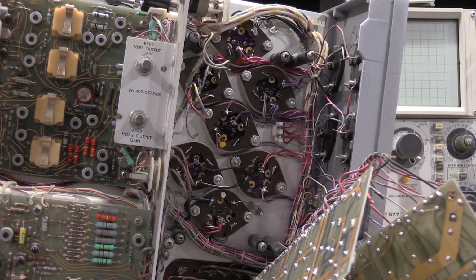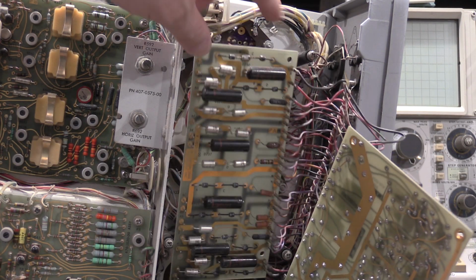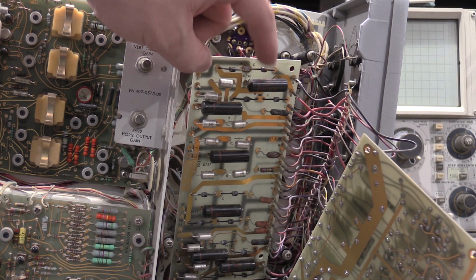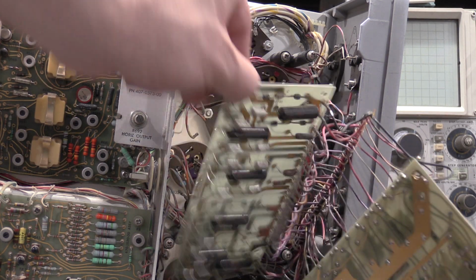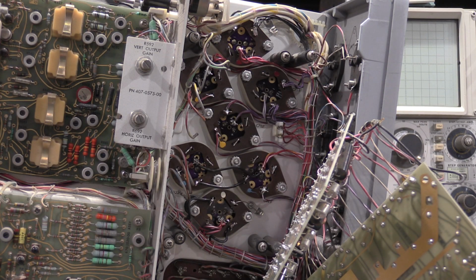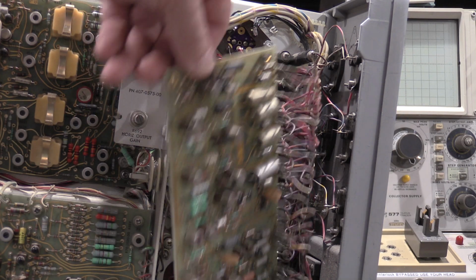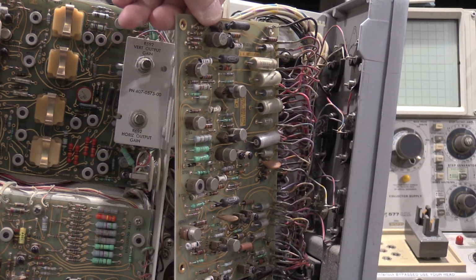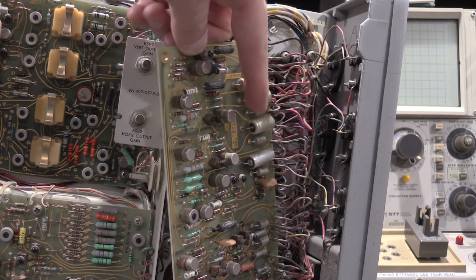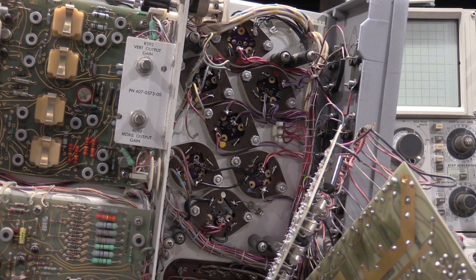So I get to move up 1 layer. This is all done. I'm going to triple check this wiring so we don't blow a cap. I did check all the polarities of the caps. They're all right. This is my next board. These Sprague caps have to go. So I got to get them out of there, get some replacements for those. And then we will see what we can do for that. And then the next stop's going to be this top board. Get this top regulator board done. And then when that board's finished with caps in that line right there, we'll finally be able to turn it on and see if I didn't break it. So we'll go from there.